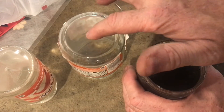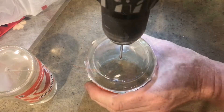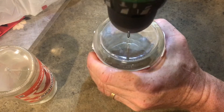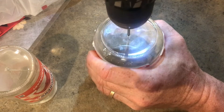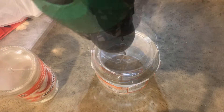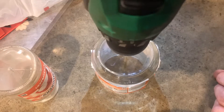I'm gonna take just a little bit of diesel fuel or kerosene and put it on here for lubrication. I wanted more control than a Dremel tool — this bit will fit a Dremel tool but I'm using a cordless drill because I can slow down the speed. Now as I'm drilling, because this is a ball-end mill bit, I can move back and forth and just keep carving through the glass.